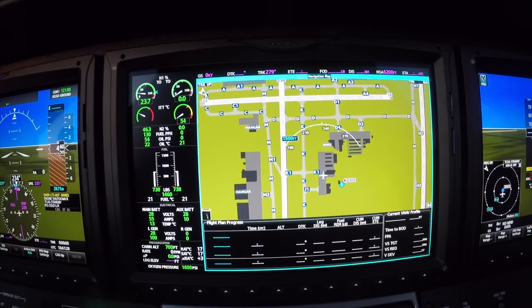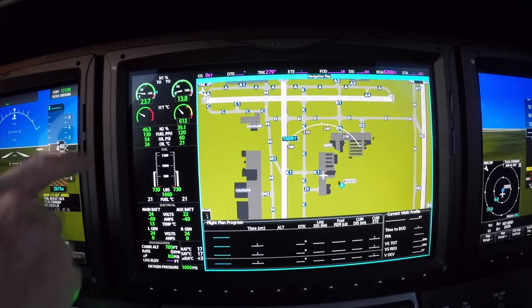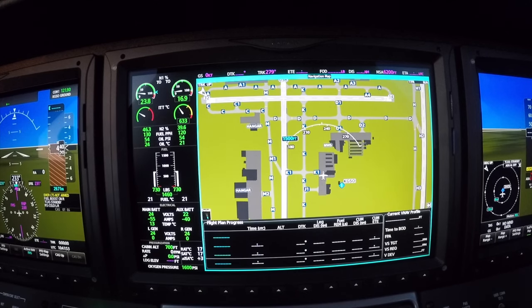System test, right, okay. I'm gonna start the right one. Same thing. Starters engage. Fuel flow, oil pressure, ignition, light off. N1 is rotating. And then we should stabilize around 23% or so. There's the second stage. And then we're just monitoring our temperature, and then at 42% it did cut off around there. It was actually a little sooner, but right in that ballpark.